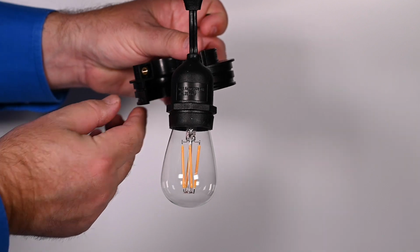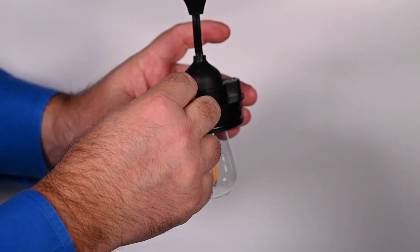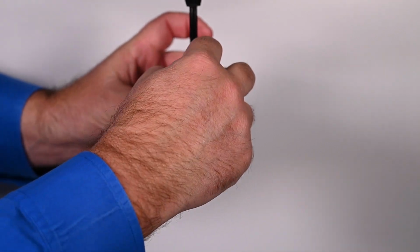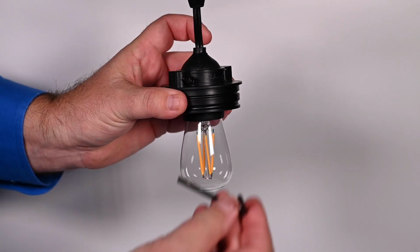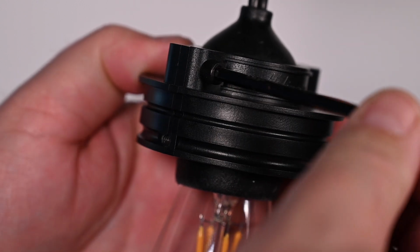To begin the installation, simply place the clamp above the hexagonal part of the bistro socket and then insert the set screw until it's finger tight. Use a 9/64 Allen key to gently snug the screw into place, and be careful not to over tighten it.